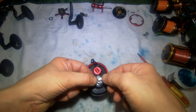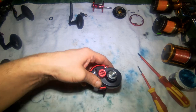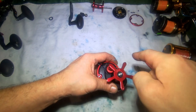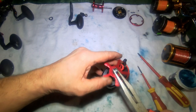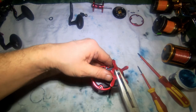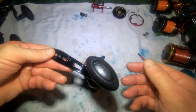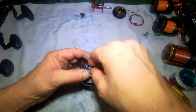The clicker sits on top of that. I like to just put a little bit of grease onto the spindle there, just up to the star drag. What can often happen with the Mark 2s is they don't want to turn — so if you hold the top of the handle there and turn it down like that you won't have any trouble. Until you start hearing it click. Then we'll refit the black washer that goes behind the handle, refit the handle — these are off a Penn squall actually, better than the ones the 525 Mags come with.